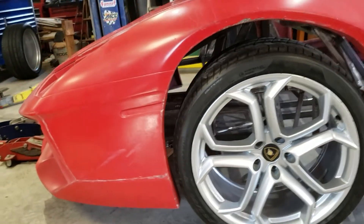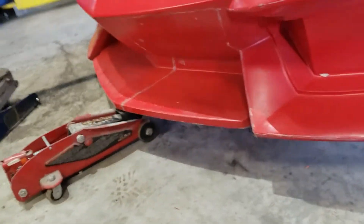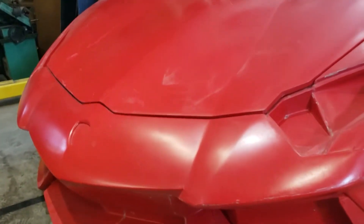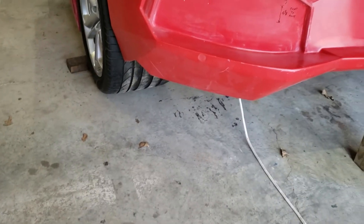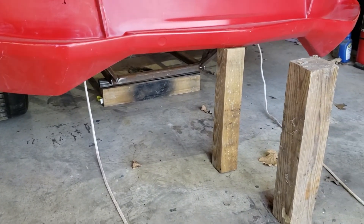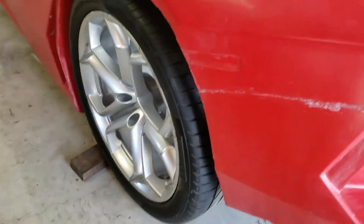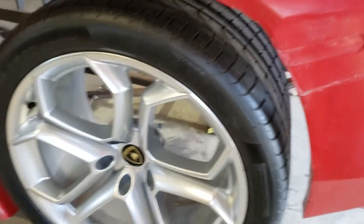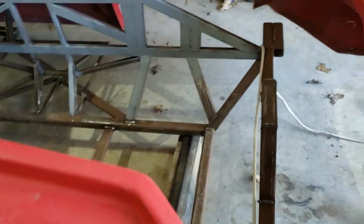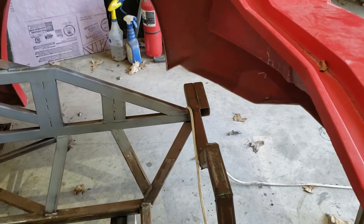I'm a little disappointed to be honest. The front is about five inches off the ground, so there's going to be some more work. The rear does sag — it's set at 16 and a half inches off the ground, which allows the wheel well openings to be where they need to be and brings the edge up to five and a quarter inches. We'll have to put some supports off the back to hold that up, but that'll come a little later.